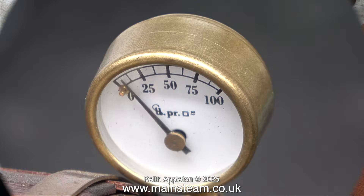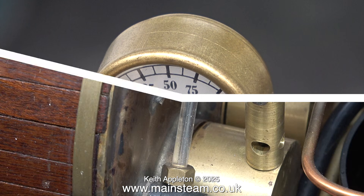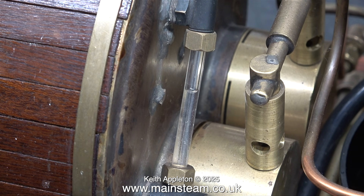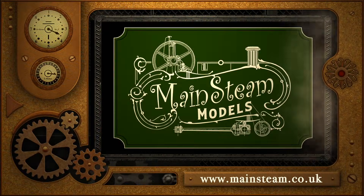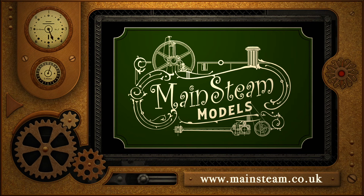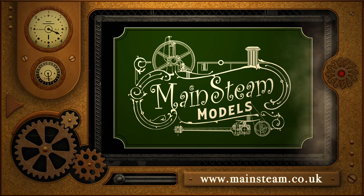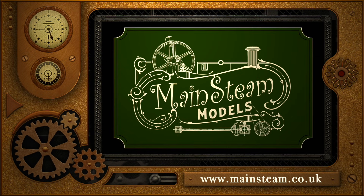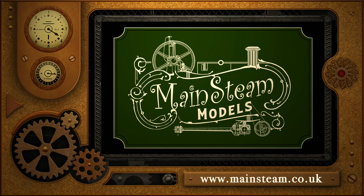To finish this steam test video I want to show you this. The pressure gauge is almost zero, but not quite. Eventually all the steam inside the boiler will disappear and be replaced with a vacuum, and that will suck in a new supply of water from the tank — like this. All ready for the next steam test. That's it for this one. Stay safe, stay healthy. Thanks for watching and I hope you've enjoyed this series. Please take the time to visit my main steam models website and click on the section that says video playlists — by doing that you can find other videos you may like to watch, and by using the playlists you can actually watch the videos back to back. Thanks for listening!